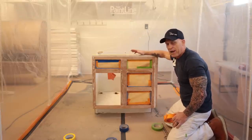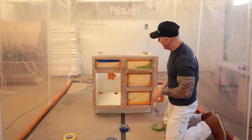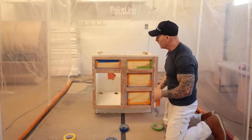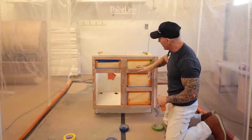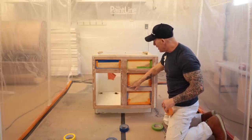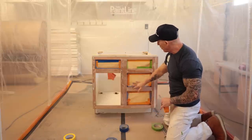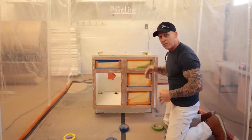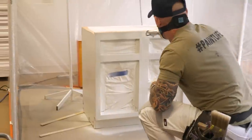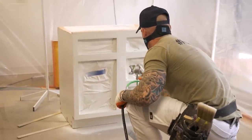One tip when spraying: we typically use an HVLP sprayer at about 4.5 PSI — really, really low pressure. If you're spraying with an airless sprayer, there's a lot more force on this masking. You definitely want to make sure it's pretty tight. If there are any leaks, an airless sprayer is going to throw way more paint inside. Make sure your masking is really tight and leak-proof, and try to spray the lowest PSI you can with an airless sprayer.